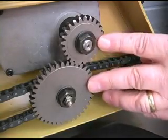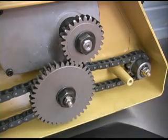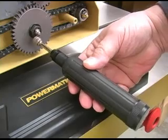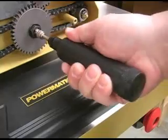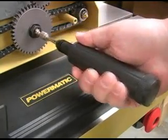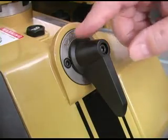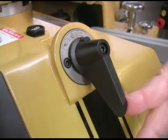These gears can be swapped on their shafts to produce a second feed rate range. The main shafts have a grease fitting in there, which makes maintenance very simple. Powermatic includes a hand-operated grease gun so you don't have any excuse for not keeping this unit maintained. With single phase motors, you use this switch on the feeder body to change between the low and high feed rates.